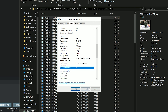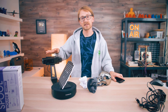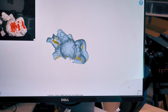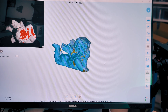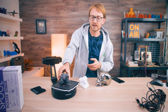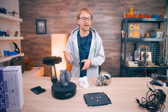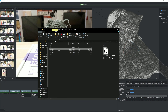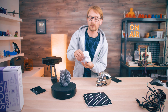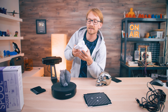You can change the defaults in Meshroom or add the focal length to the image metadata, but that's an extra step each time you want to scan something. When it comes to getting the 3D model out of your software, the Einscan software lets you merge different scan perspectives automatically and trim unwanted objects — like the platform your model sits on — very easily. With photogrammetry, Meshroom gives you the raw mesh — just a raw OBJ file — and then you have to take it into another piece of software to trim off unwanted edges.